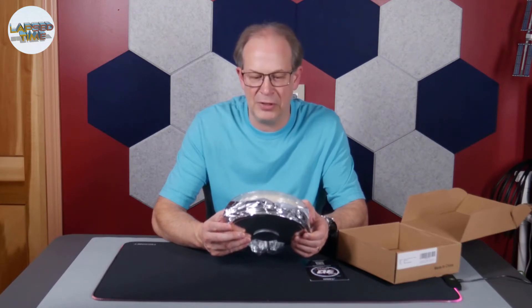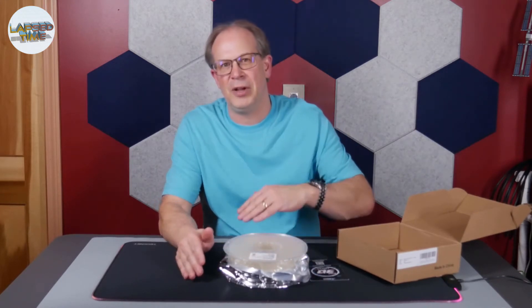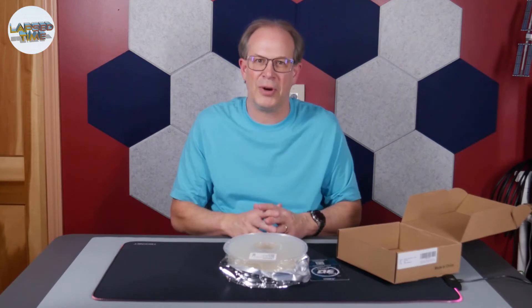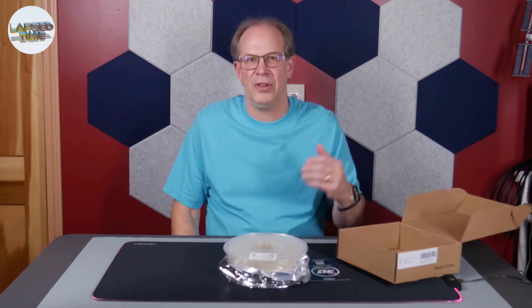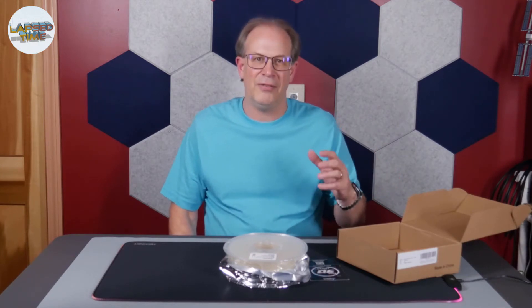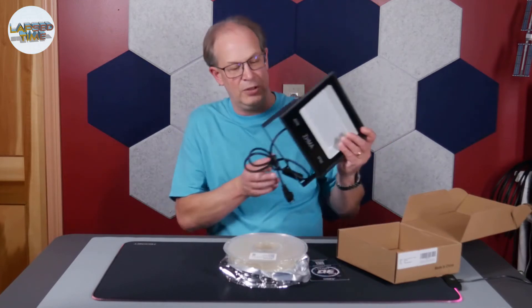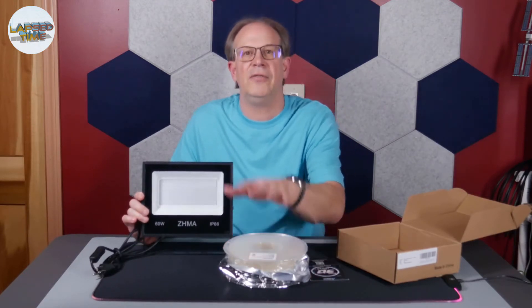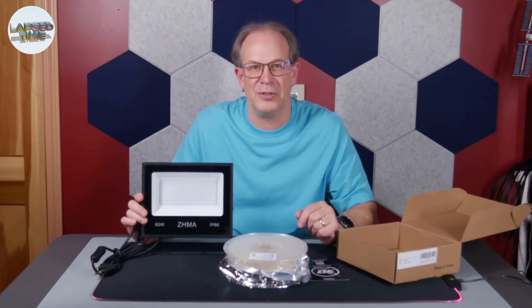Recommended settings are print temperatures 190 to 220 degrees Celsius, speed 30 to 60 millimeters a second. This is a multi-color filament, so it also changes color depending on how much is extruded and built into the model. The other thing I wanted to try is seeing some different options to capture the time-lapse video of the actual print. To get the glow-in-the-dark to work you need a UV light — I purchased one. While you can leave it exposed to regular lights and it'll glow in the dark, it's best under a UV light — think blacklight posters and those types of things.